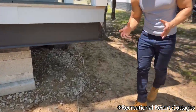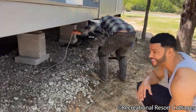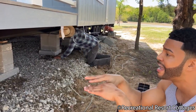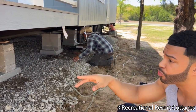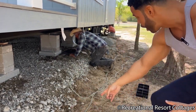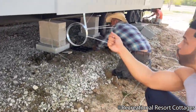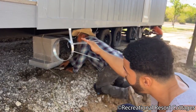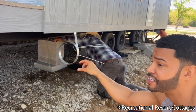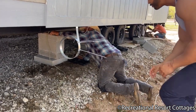And now the process that is taking place is the water leveling. We have a jug that you saw at the end of the home, which is at the height that the home needs to be brought up to, where the beam and axle meets. So that gives us the direction on the level setting. As you can see, this hose is brought to each section, and as they place it right where it is level underneath, the water actually rises and sets at the area that the blocking needs to be completed at. So you can see everything here is on that level.